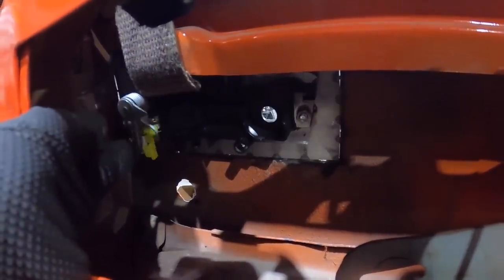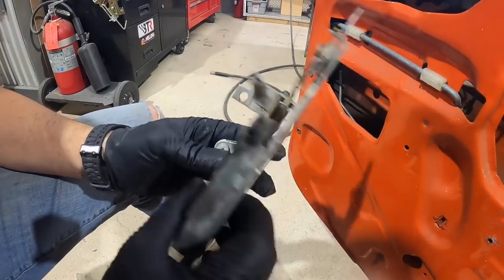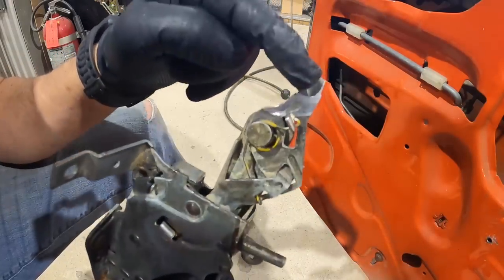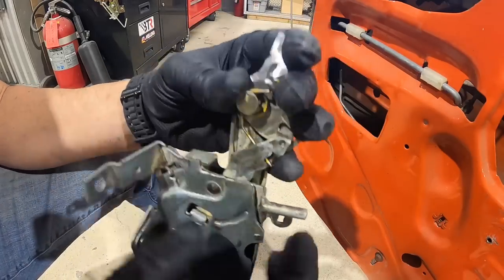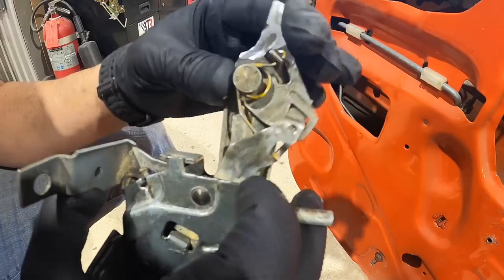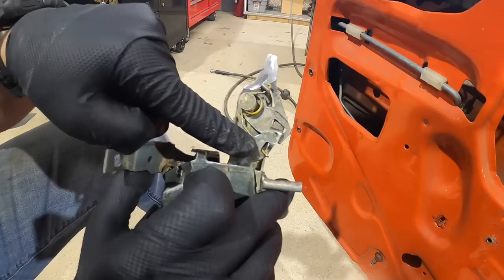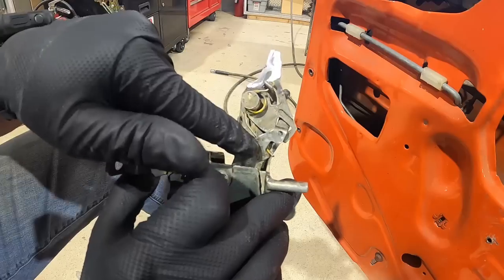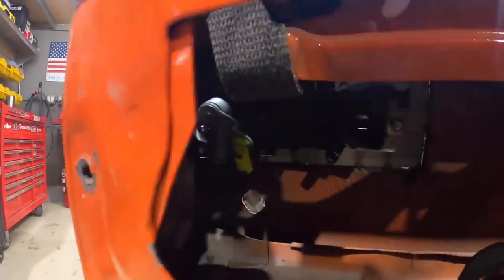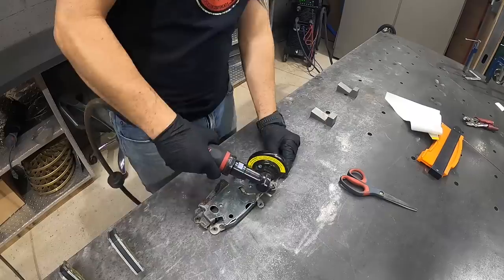This little yellow tab is doing an upward motion — pulling up — and that's what we want. When I was studying our old latch mechanism, I can see the actual mechanism that's opening is right here. So what I'm going to do is cut this bracket away, expose just this lever or linkage piece, drill a hole in it, and put a linkage from here up to that yellow tab. That should pull up on it and open the door.